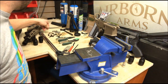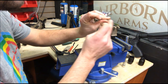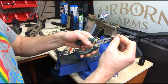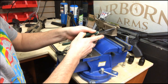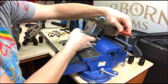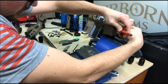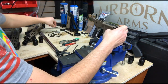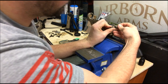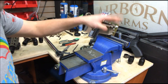First step — starting up front. Add the weaker spring. There are three springs that look similar in length; both the weaker ones are for the detents. Grab this little piece with needle nose pliers, push it in here, use a flat punch to hold it all the way in. I've got an extra long one — put it in from the other side to hold it. Grab it with this one so it stays in as you're pushing it back through; that avoids the need for a special tool. Once it's in, make sure you can pop it back out, push it in — it works, it locks. That piece is done.